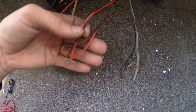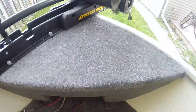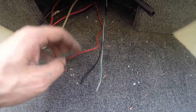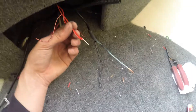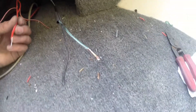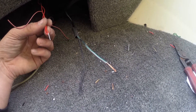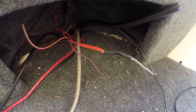Each light has a red and black wire — red positive, black negative. These are my old nav lights going to the receptacle on the deck up here. Black is negative; this gray-green is positive. All you're going to do is put the two negatives together and the two positives together. I'm going to solder them — you can use butt connectors or whatever you want, but soldering with shrink tubing over it is probably your best option. Shorten the wires, strip them back about three-quarters of an inch, twist the two positives together, put some shrink tubing over the positive feed line, then connect and solder them up. Just twist them together first so they're held firmly before soldering. Do the same with the negative and you're all set.